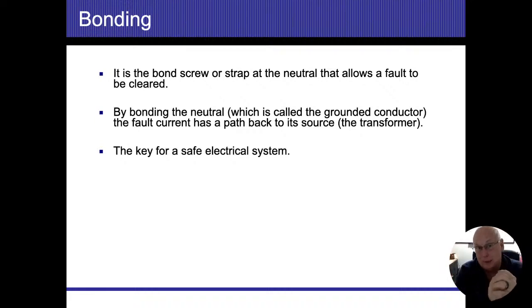Nothing else goes in with that GEC. If the GEC has insulation on it, all right, then that should have a mechanical connection because we want to use the conduit as well that protects the GEC. We want to use the conduit as part of our grounding system. So we need to have a mechanical connection pretty much at both ends to the conduit. If it does not have insulation, so it's a bare conductor for the GEC, those are not required to have a mechanical or a metal connection at each end. So we don't have to tie it to the conduit. It makes sense because obviously if it's bare through and through, then most likely it's going to be touching that conduit in multiple places. So no splices. Number 6 or number 2, 150 amps is my line in the sand. Nothing else shares in the conduit with it.